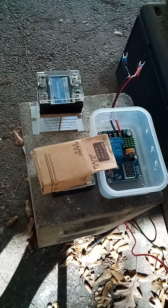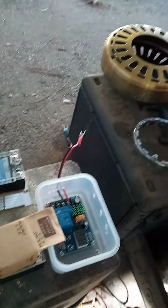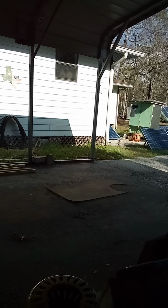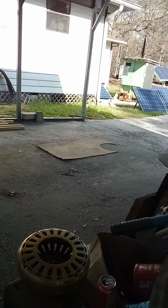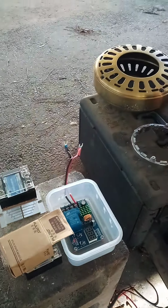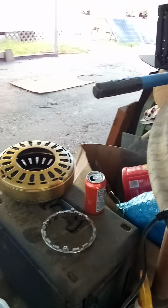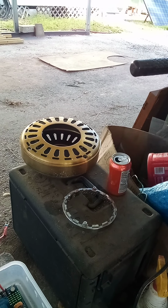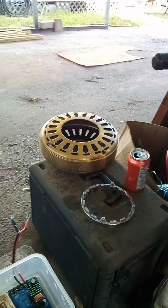But anyway, I got to figure something out to where I can have that thing working, so it doesn't overvoltage my inverter in there, and it'll have more stable power going into the inverter, so that it'll stay on the power and convert it, whatever. Or even on my batteries. If I had it on my batteries, it would overcharge the batteries. But I'm always using the batteries, so the batteries pretty much have to draw on it anyway, so I could put it on the batteries and just let it sit there and charge. Unless we got a whole lot of wind like we did the other day.